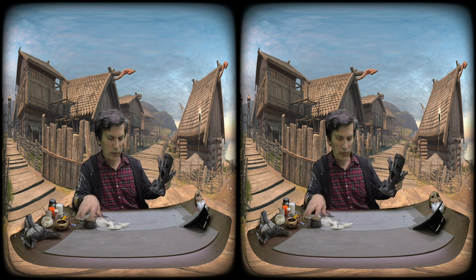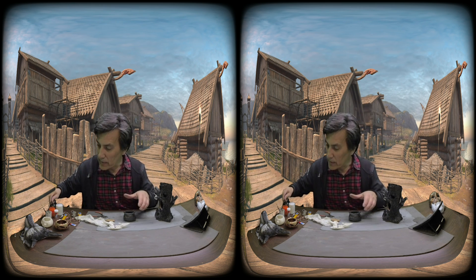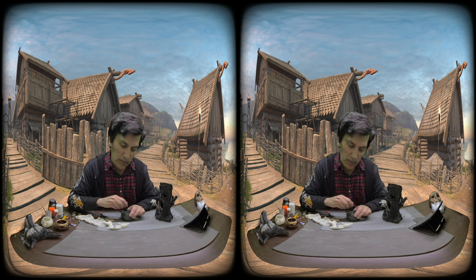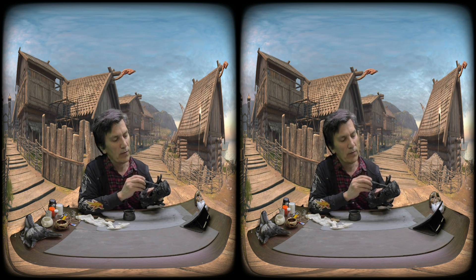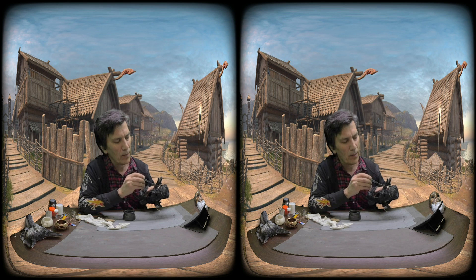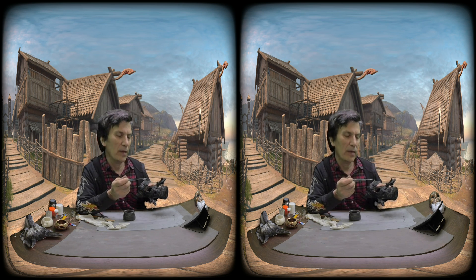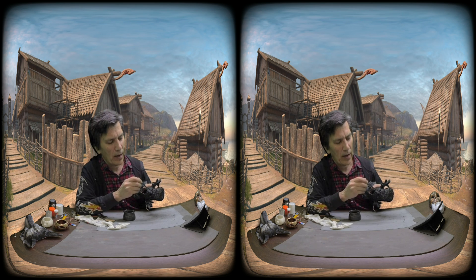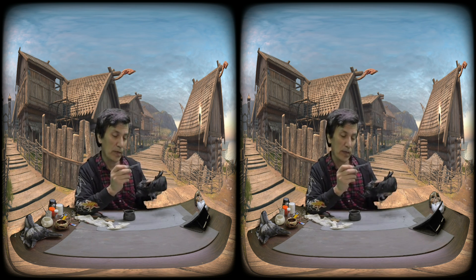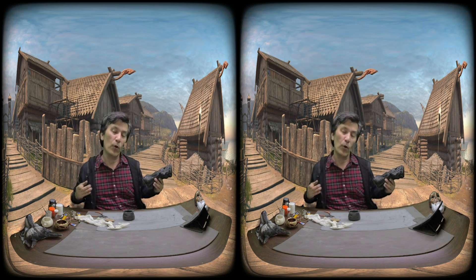Same with this guy right here — I'm just going to use a brush and paint it. It's not a terribly exciting process, but we need to really get into the particulars about applying paint. We just want to give it full coverage. This is a conductive paint; prior videos have recipes on how to make this paint. It's great because it actually shrinks, making it a good sealant. When making a conductive paint, you want a binder that shrinks because it takes those graphite particles and brings them closer together.